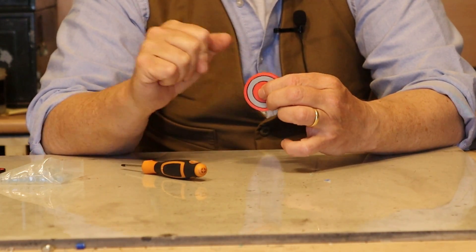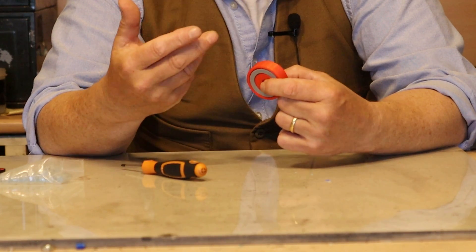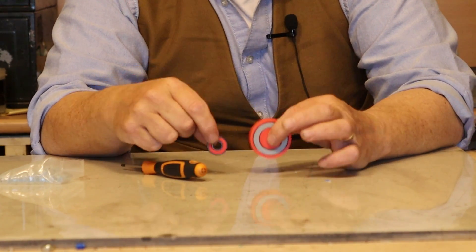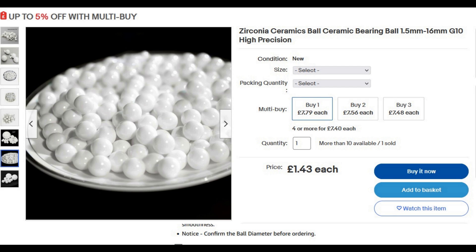When the glue's gone off, that's what you get: one waterproof glass bearing. You can in fact buy glass bearings if you want — you'll find them a little expensive, but you can buy them. That's how to go about making them. If you want steel, replace it with stainless steel and you're still going to have a pretty good bearing — certainly better than you can 3D print, probably not as good as a bought bearing, but a lot of fun to make. I paid £10 for a hundred of these, and you could make about 40 for the same price you'd have to buy them for. You could also use ceramic — a little more expensive, but available on eBay or Amazon. Now, one thing to notice on the cage: one of the indentations is smaller than the others — that's just a quirk of the drawing package. Line up the two small indentations before you glue it on and you'll have yourself a glass bearing.